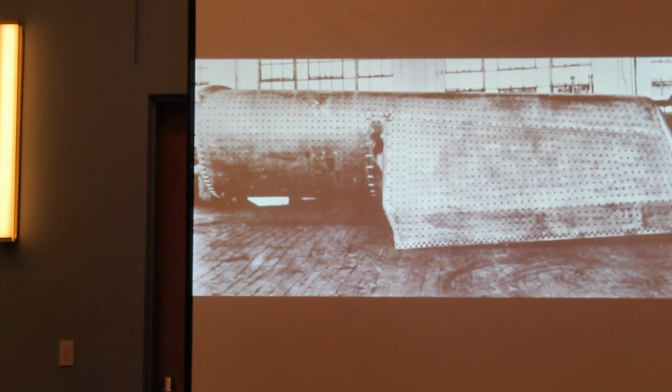And you have to worry about carbon content in the steel. If it's too low, the material will be too weak as it tends to crack. If the carbon content's too high, you're going to have a very similar issue. It's going to want to crack, especially because of the quick cooling of the weld metal.